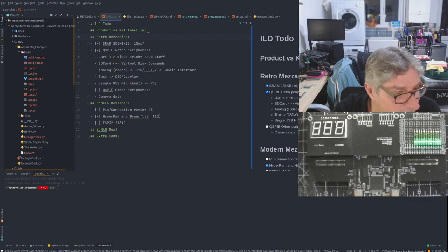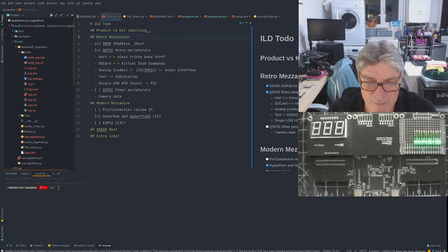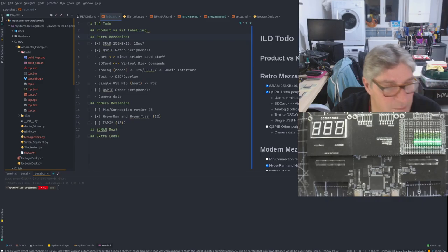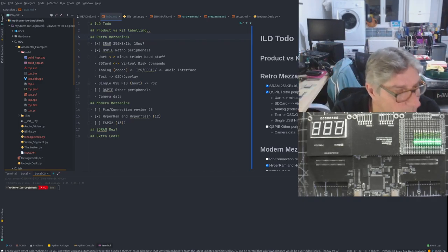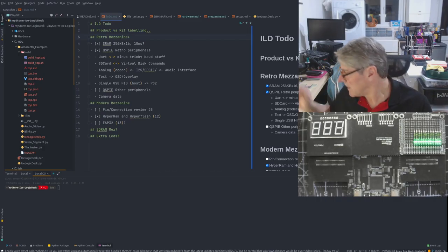Let's see. There must be other options for the five pins. Audio connector is a possibility. Depends what you mean by audio connector. Are you talking about like a bit-banged FPGA GPIO to a jack, that simple kind of stuff? Buttons and LEDs, but a bit boring. Small SPI LCD display. Well, yes, you could do the small LCD display, but is that worth it? Or do we go for a better parallel one? I think you can have a better parallel one for a similar price. I mean, just two pins for stereo audio. Yeah, so that's direct bits. Yeah, you could do that.